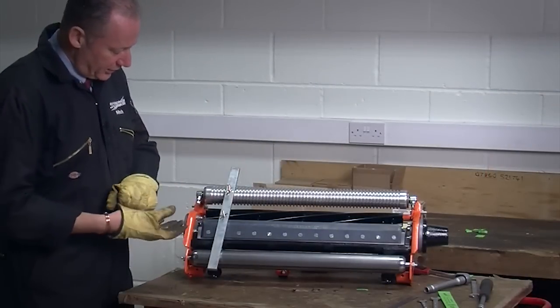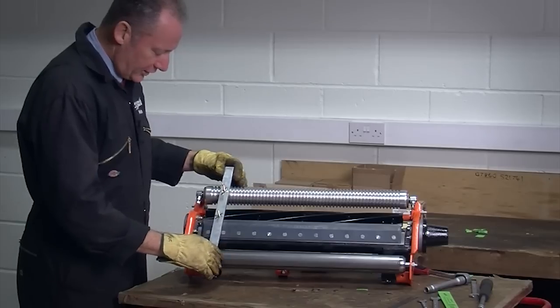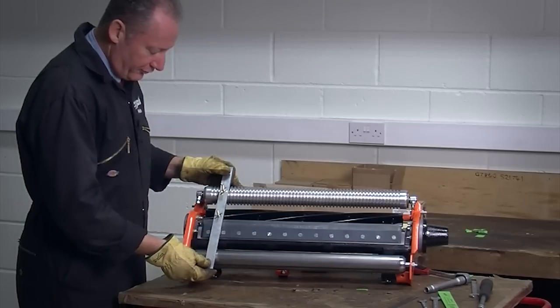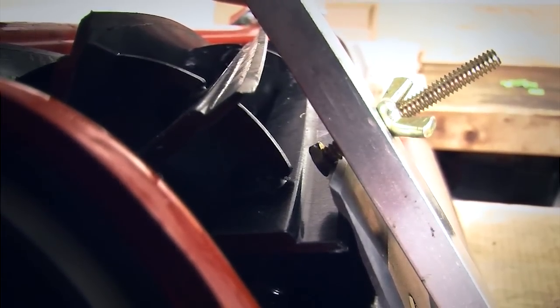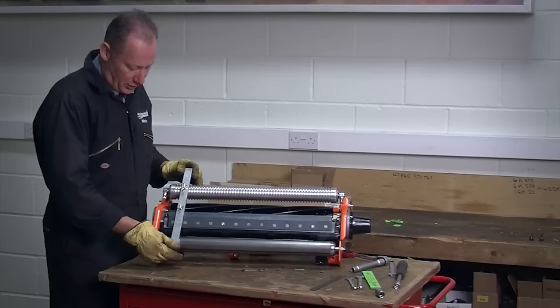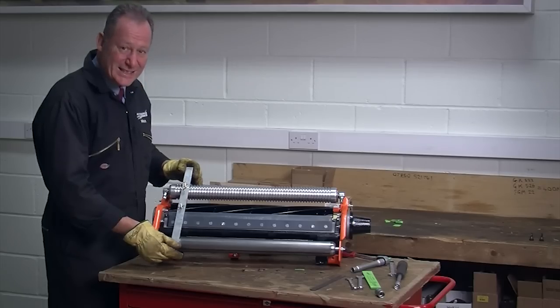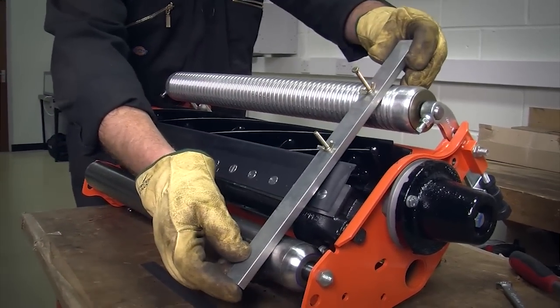I don't want to cut my fingers. I can now check. What I'm looking for is a smooth sliding fit — not forcing the screw under the blade and bending it, but a smooth easy fit at either end of my cutting unit. The idea is that the cutting blade sits underneath that screw head and gives me an accurate measurement between the front roller and the underside of the screw head.